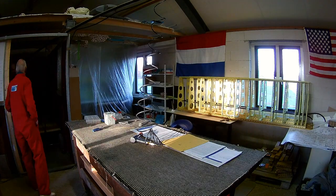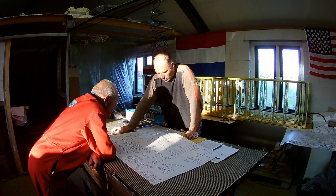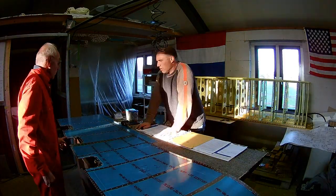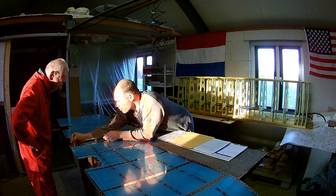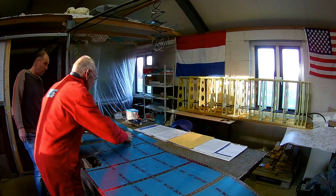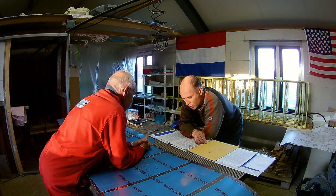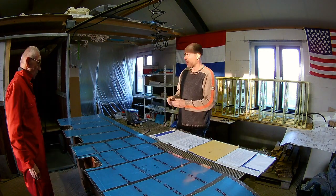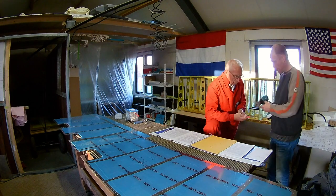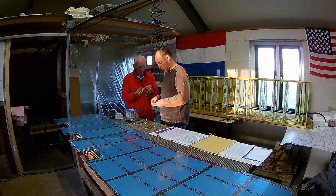The inboard and outboard skins overlap, and where they overlap the manual says you have to trim them down on the front side — I guess to reduce drag. It's where the tank skin meets the double wing skin. We decided not to take too much off, and we tried different things. We first tried it with a kind of drill, but that really wasn't working very well — it took off too little material.